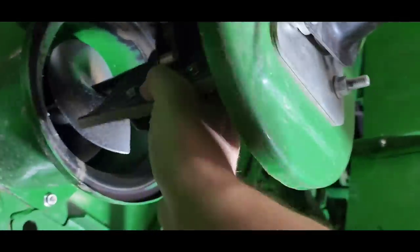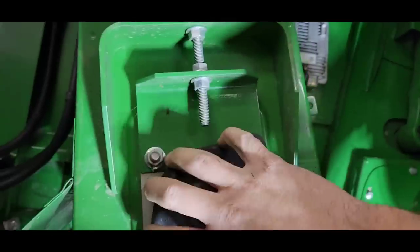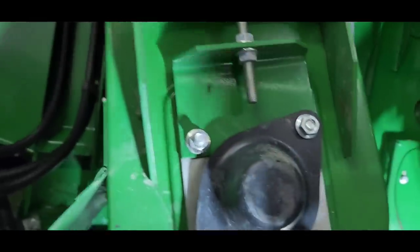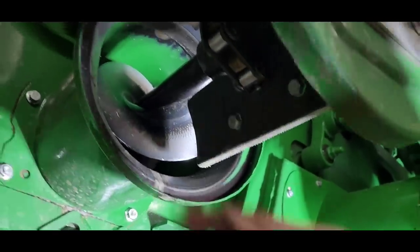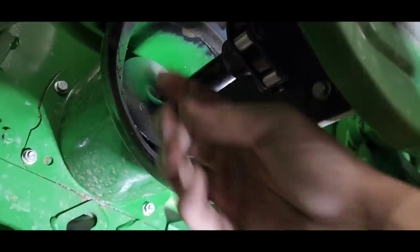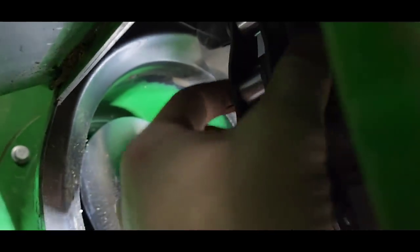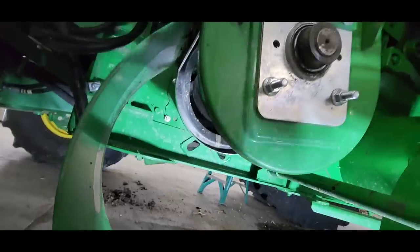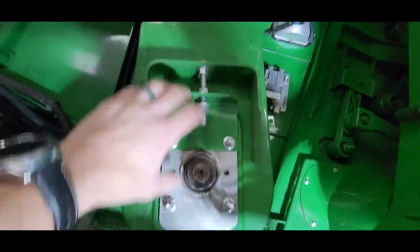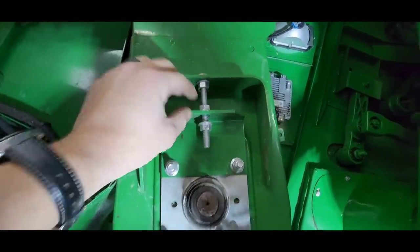But it's pretty easy to tighten. So we'll just go ahead and do that. We just got to loosen up this stuff here, bring this bolt down. We got lots of adjustment left, it looks like, so we don't have to worry about removing a connector link, which right there it is if we did. That's convenient, these pins right there. You can take that half link out when you run out of adjustment. All right, so I got this all loosened up. We loosened this bottom nut off. This one I haven't turned yet, so that's where it started.